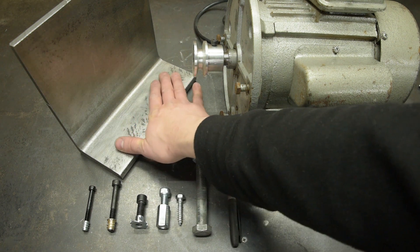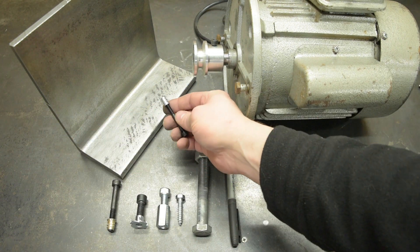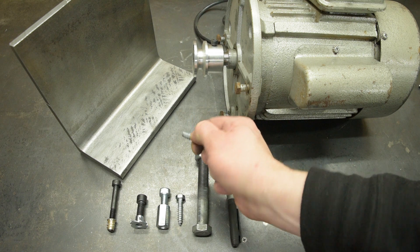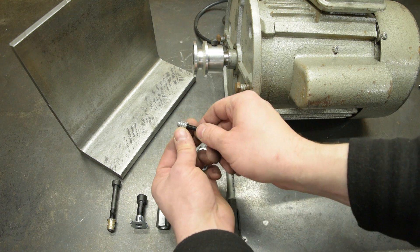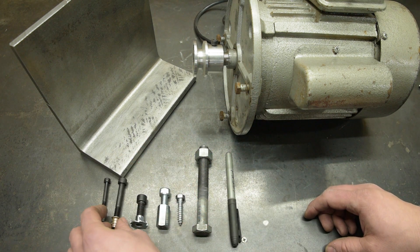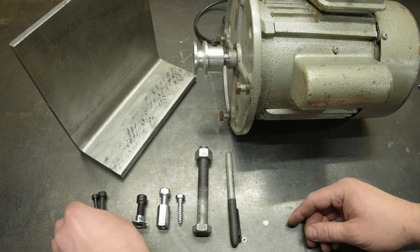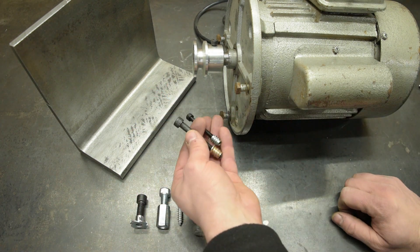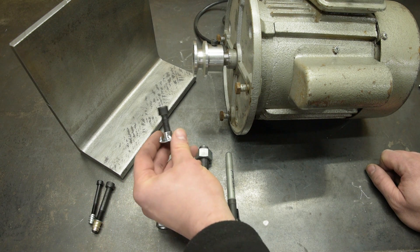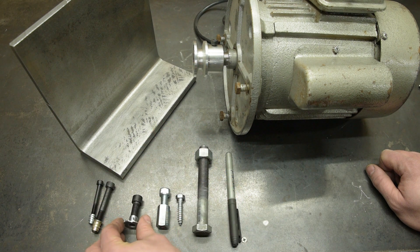When it comes to fitting this to the frame I've got a few options. My initial thoughts were to use this style of threaded insert — you put a nut on the screw and thread the outer into the wood. It basically gives a machine screw fitting that you can use and reuse without it wearing out, and you can get them with or without flanges. Since I'm only going to have two screws mounting this, those are a bit undersized — I'd really like M10 or above, but in M10 the only threaded inserts I've got are a style which don't really work in this situation.